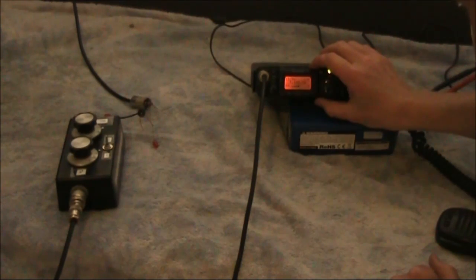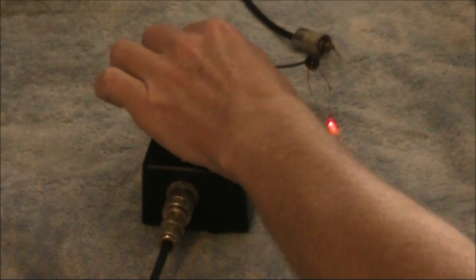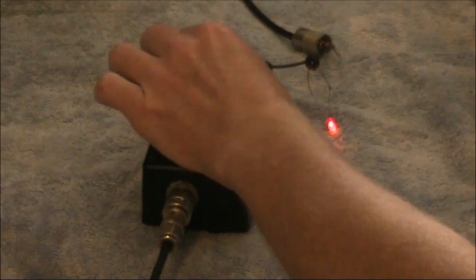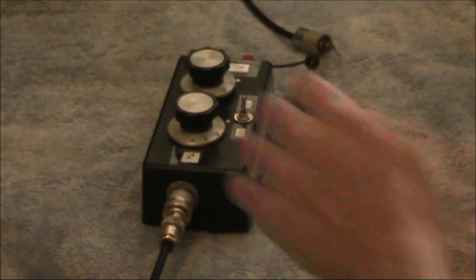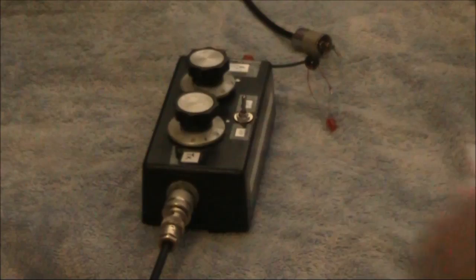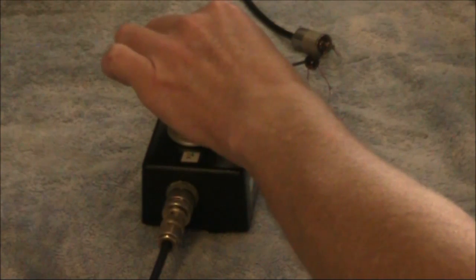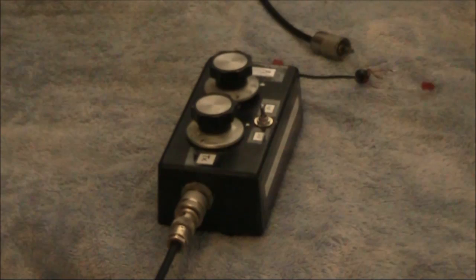This has been on 7MHz. Let's try some other frequencies — 10MHz, 14, 15, 18, and 21MHz. This works perfectly on all bands from 3.5 to 21MHz. The maximum brightness coincides perfectly with the lowest SWR, at least as indicated on the FT817.